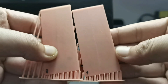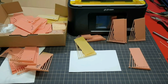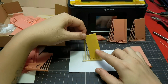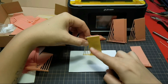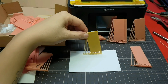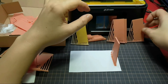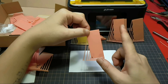Right before, left after. Hello everyone, back again with Dennis Wang. On my previous video about troubleshooting the Sonic Mini 4K, someone commented that their printer still has wobble lines. In that video, all of the test prints I did had the flat side facing the Y-axis. After reading the comment, I did more tests by printing two models at a time — one facing Y and another facing X-axis — and yes, I found wobble lines on the X-axis. So the Sonic Mini 4K only has a single linear rail.